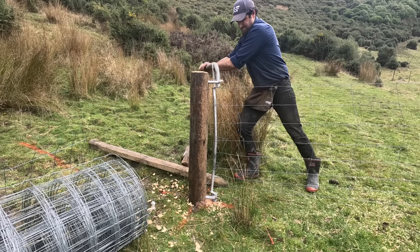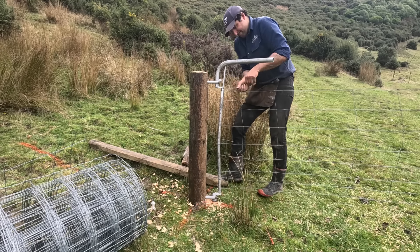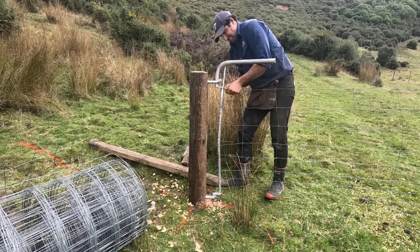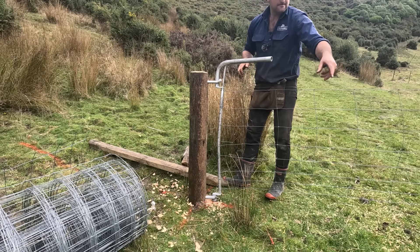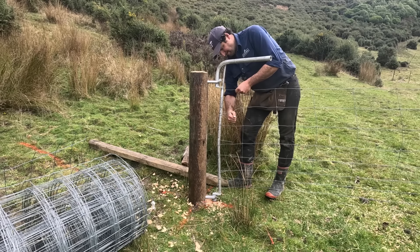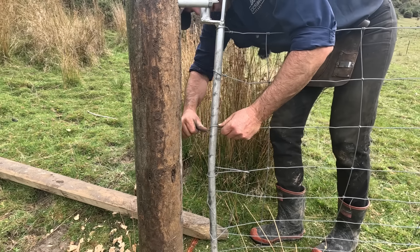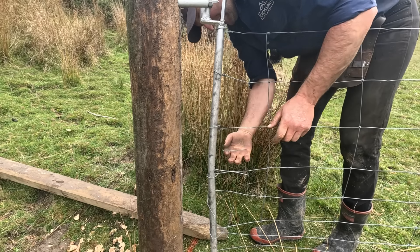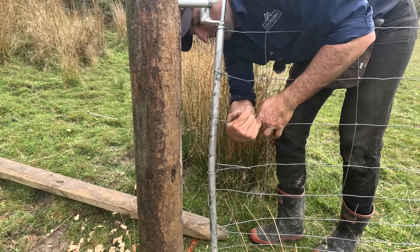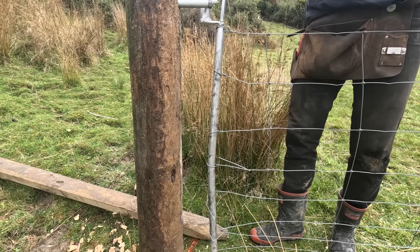That's tight - it's good. We're just doing two or three wraps and then we can just snap it off. I'll bring you in close to show you how we do that. We've got our wire through, bring it around, make a handle like that, and then we can just do one, two, three wraps. Then what you want to do is bring the wire handle back towards you, rotate it around alongside the wire, and snap - makes it nice and clean.